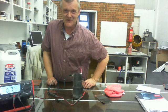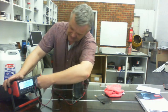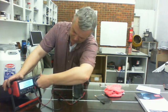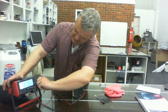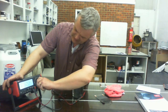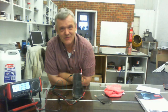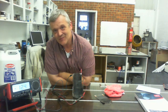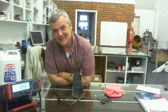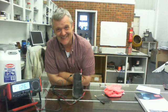Let me swap it onto the voltage reading for you. There we go — getting about 12.2 millivolts, and again, that will climb up. Obviously those voltage readings aren't anything to shake the earth about, but we're generating both current and voltage from nothing more than distilled water and carbon. That's really, really interesting.